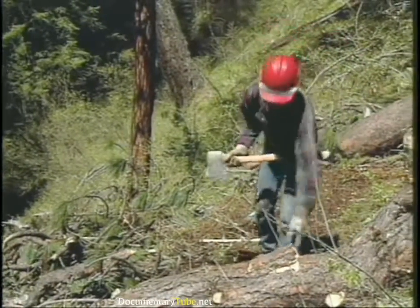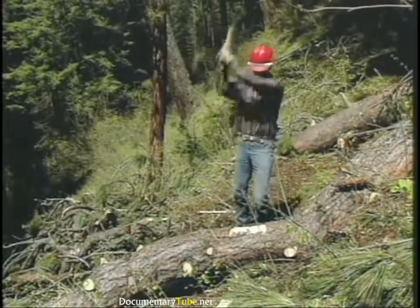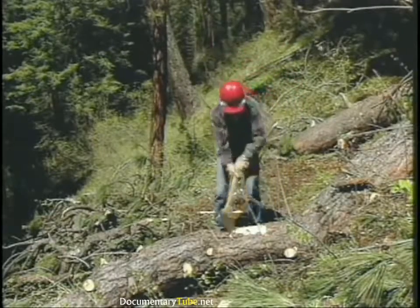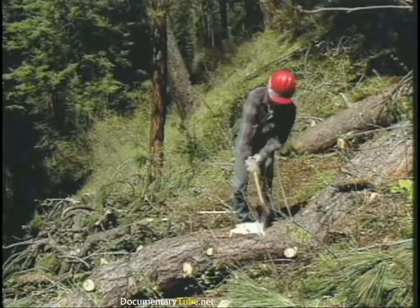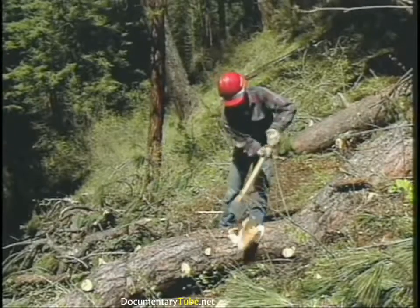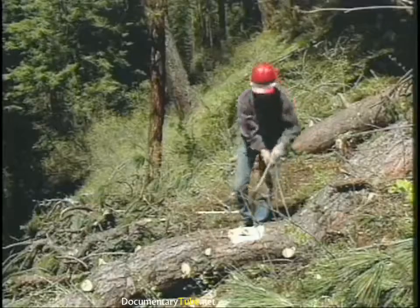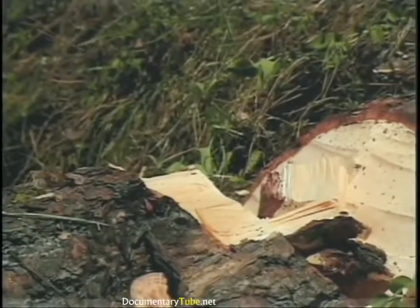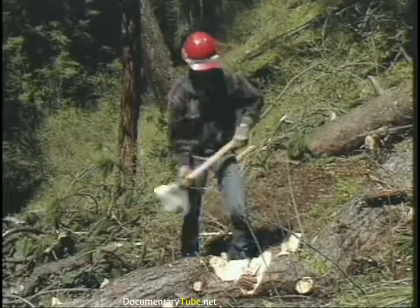Try to be as efficient as possible. Strike that wood as many times as it takes to completely sever your cutting surface, then move to the other side — instead of making a chop on one side, then the other, back and forth, three times in succession and then breaking it. On a large log, you're not going to remove your first chips by making a wide cut. Start with a narrower V in your cut and cut down until your V comes to closure, then go back up and reopen your cut so that it's wider.